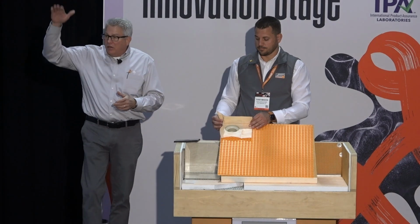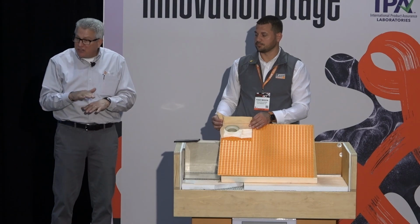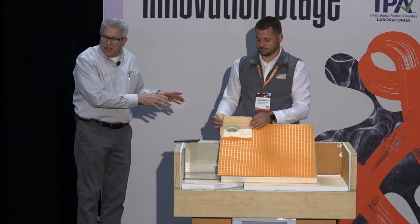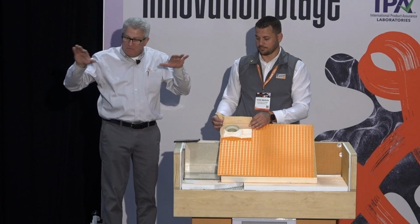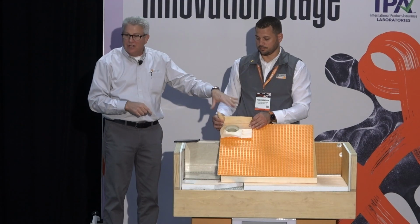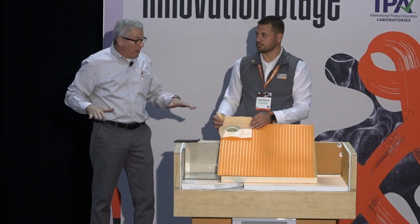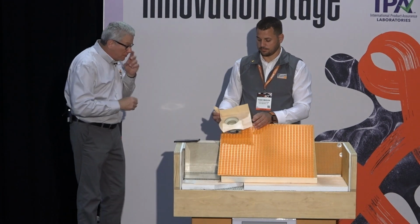If you get into multi-rise housing where it's actually concrete slabs that are post-tension or precast concrete, the structural ones, you can't core drill, you can't move that drain around. It has to pretty much be wherever they put it initially. So this is kind of nice for that too. And you can slope, you can pack your pan like we've been doing for decades in the tile industry with your sand and cement mortar to create your slope down to the drain. You would do the same thing right to this, and this would be your drain. And of course in there, you might just go ahead and lay this out onto another piece of Kerdi that goes over your entire shower pan instead of on a Ditra. But Ditra, Kerdi, it doesn't matter to us, you can use either one. So a lot of flexibility in that case.